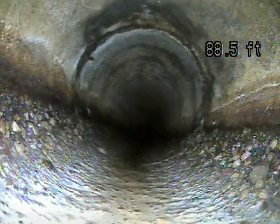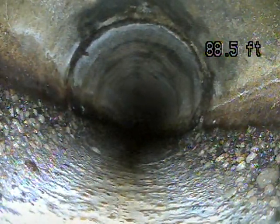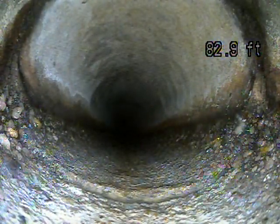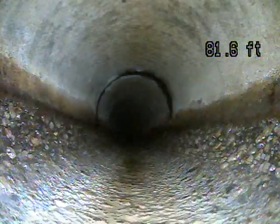Watch these different fittings as we go past them — I'll stop at the significant ones. This is gravel cement. If you look at the bottom of the pipe, how it's got that exposed aggregate — that's the giveaway that it's gravel cement.